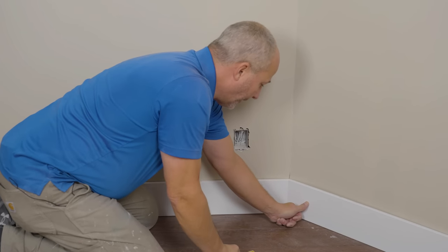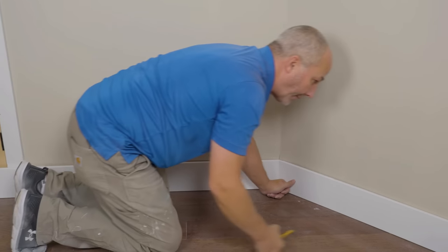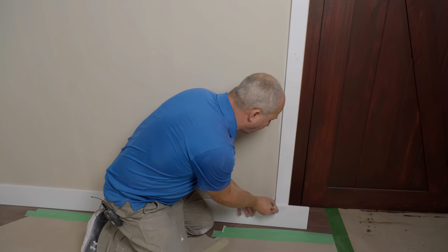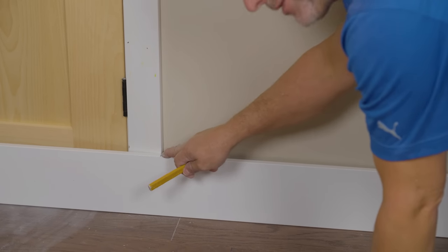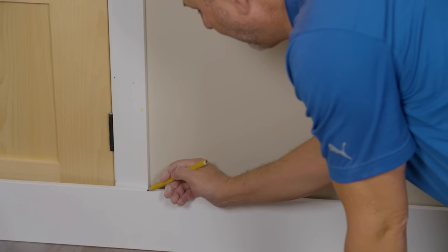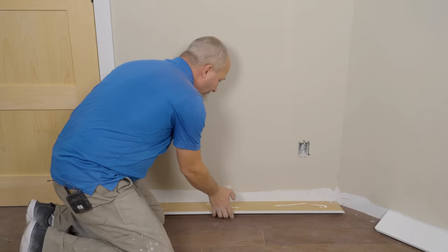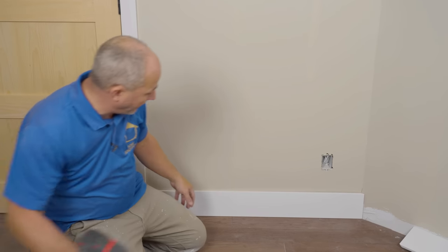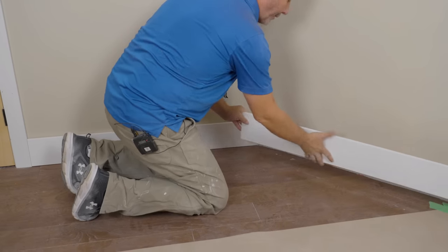The wall is going to have bends, curves, twists — you can't try to make all of your measurements based on that. Set it nice and easy. There's a gap? We'll fix it. Now that I've got that in location, I come over to the other end and set the pencil mark — now there's my cut for that side. We'll go to the other side and make this measurement. That's an exact length but it's also on an open angle. In this case, I'm going to put it on the saw standing up and cut the pencil line, because if I take off that little thirty-second of an inch, it'll fit into the gap. We can save ourselves a lot of nails just by using a little bit of adhesive. I'm assuming there's going to be wood coming off that electrical box — and there was.